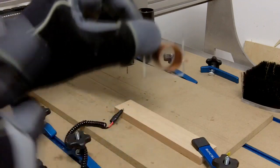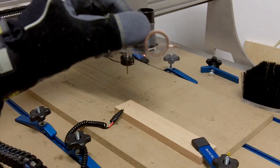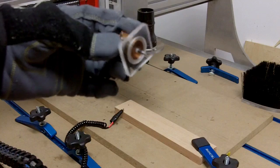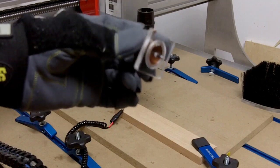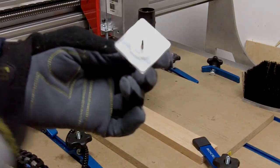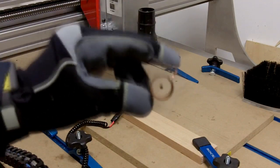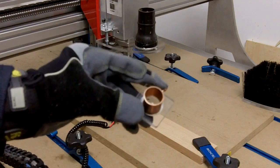Precisely in the middle of this plexiglass piece I have machined a hole — an eighth of an inch — and I placed an eighth of an inch pin in it. This pin is actually a salvaged carbide tool that I had broken off. You'll see how this is used in a minute — it's a very simple design to allow me to find the center. The tool with the touch probe finds the exact center, so this probe is for my X0 and Y0. You can also use it for Z0 by measuring the total height and having the tool touch the top of the copper piece.